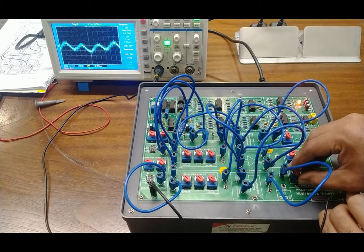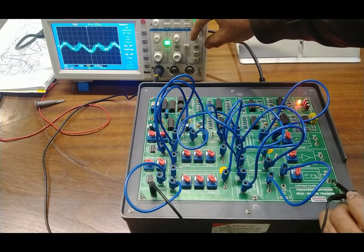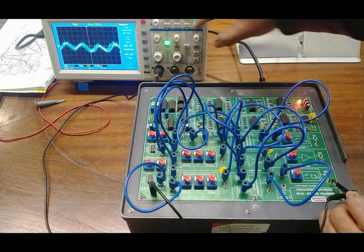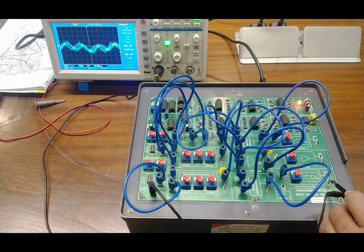There is a slight ground ripple present. The output we are getting is approximately a sine wave near the expected value. The ground ripple is considerable for the output of the second modulation index. Since this is a training board for experimental purposes, the higher-quality filters used in industrial applications would perform better. The ground ripple here can vary depending on component values and can be adjusted accordingly.